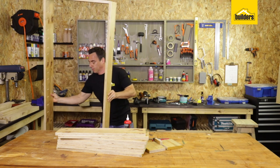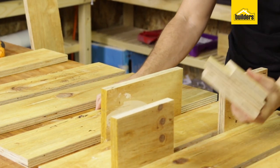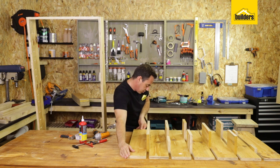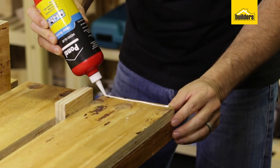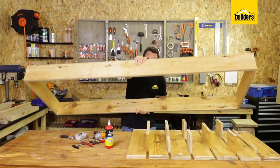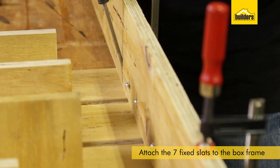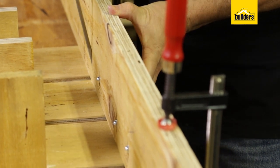I'm going to move this out the way. These are our slats — I'm just going to lay them out on the edge using standard off-cut pieces as spacers so I get the same spacing for every slat. I've got seven slats to do. I'll line everything up with the edge of my bench so every piece is in line, then put some wood glue on both sides. The framework comes back in and is placed on top, clamped into place with equal spacing on every single slat. I'll get a production line going and get all the Kreg screws in, driving them down into the timber, double-checking I've got a flush edge on the outer surface.